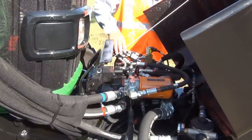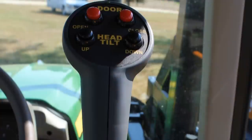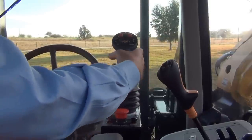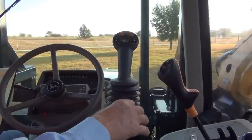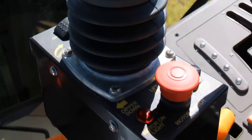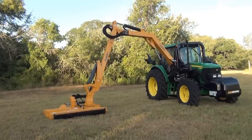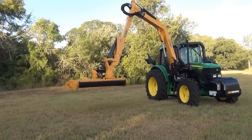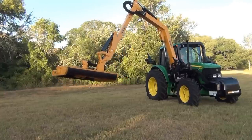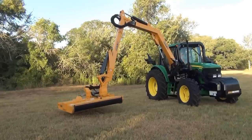You'll find color coding also on the control valve system. Controls for the boom are with the five-function single joystick, both easy to use and instinctive for the operator. Three functions — the main boom, dipper, and swing — are proportional controls, allowing the operator precise movement when working around obstructions such as trees and signs. Also note the cutting head emergency stop switch located convenient to the operator. The further the joystick is moved, the faster the response, so it is possible to very carefully creep the cutting head or move quite quickly.